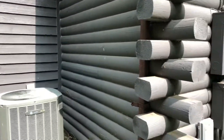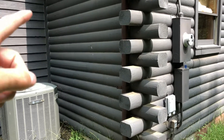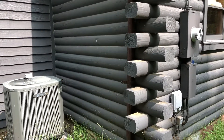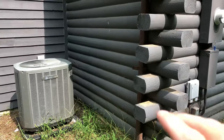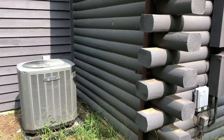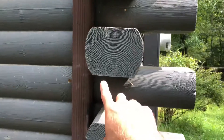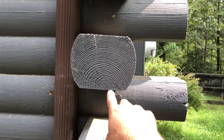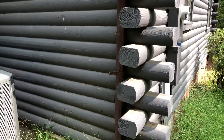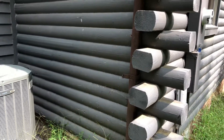You're going to want to look at all of those factors. Inside you can see a little bit of separation right along the edge here — some separation and movement inside. This is definitely something that's going to cost some money. For example, this particular log to replace would probably be about $500. The good news, the saving grace, is there's no tongue and groove, so they can use what they want as long as they match the size diameter of the log — as long as the new log does not have a tongue and groove.